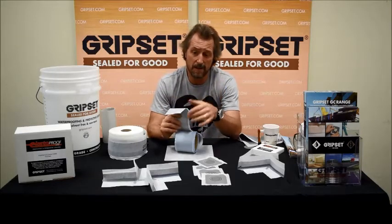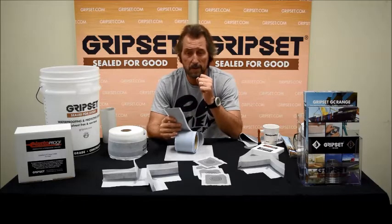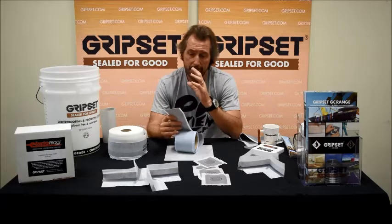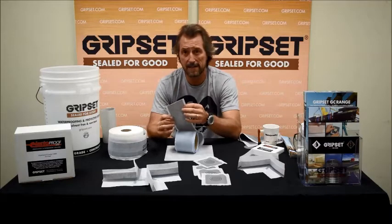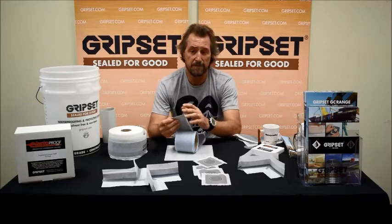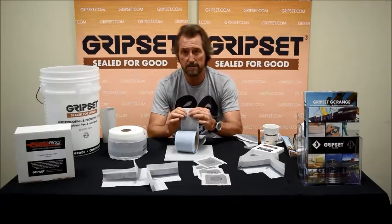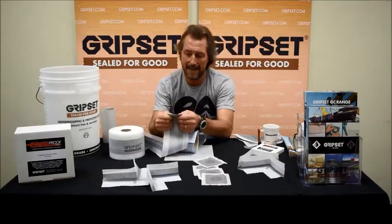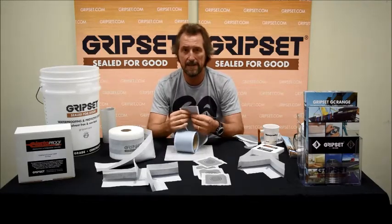In cold climates — our friends in New Zealand where we sell a lot of this — with bitumens you need a special primer to get them to bond, but with this product no primer is required on a sealed surface, as long as it's clean. It will bond to glass, glazed surfaces, metal, and stainless steel. We're getting a lot of use now in timber structures. It's an instant seal; the rubber is flexible but unlike our Elastoproof joint band it doesn't have elastic recovery — it's designed differently, still waterproof, with very good rupture resistance.